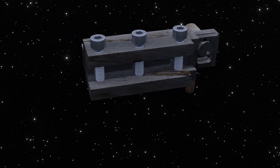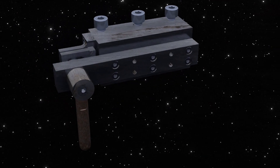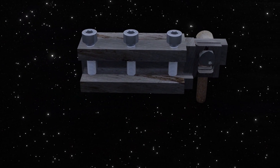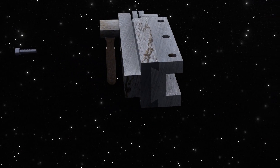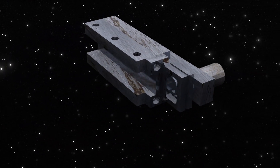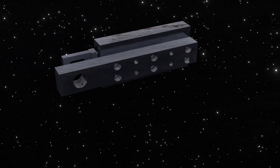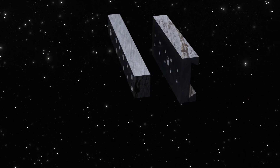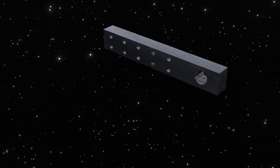This is the design of a retractable tool holder for a lathe. Let's dismantle it so individual parts can be seen separately. A few design principles have been followed: the tool should be rigid, especially when it is in cutting position. There should be no adjustable parts, movement should be forced, and no springs should be used.